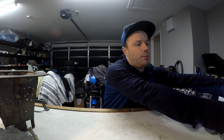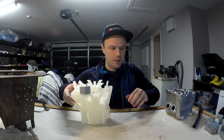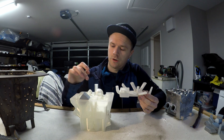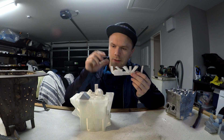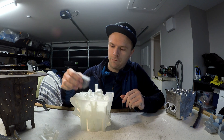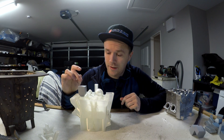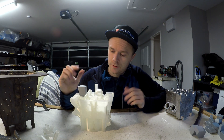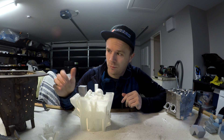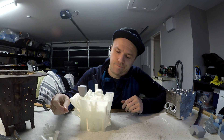The new plan: I have already printed off another head, which took two days to print. The sprue was too big on this one — it didn't have enough of a choke at the bottom, causing imperfections. So I've made it smaller again with a little more of a choke so I can keep it full and avoid extra turbulence and imperfections. I've printed all of the feeders individually in PLA — I'm not too worried about the surface finish on the feeders, only the cylinder head itself matters. I've got to glue all this together and I'm going to have another go at casting today, doing gravity casting this time. My welding helmet decided to stop working so I can't weld anything, which is just typical, but oh well.